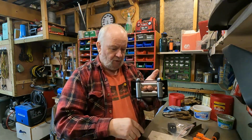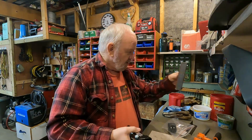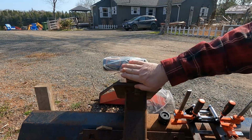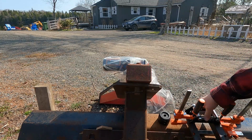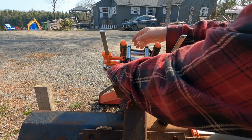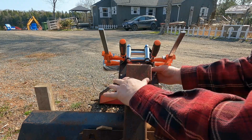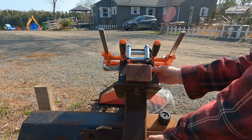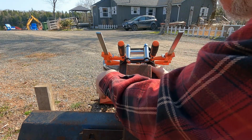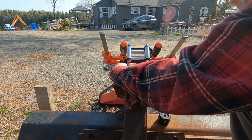So what I'm up to here this morning is, I need to take this fair lead and bolt it on my pieces of angle iron here. So this is the drawbar, we're gonna call it. I have this set so that it'll go one on either side here. I don't want it sitting on top of this plate because that plate rotates, so I've got a couple of little wooden spacers I'm just going to put under there. And then I put a clamp across here to hold it.